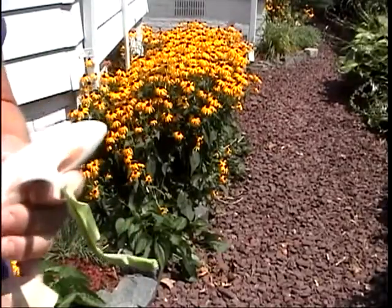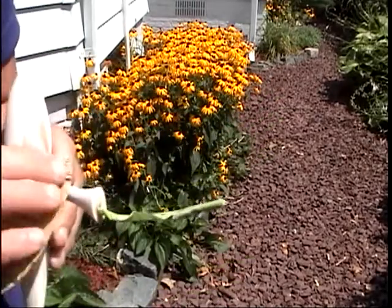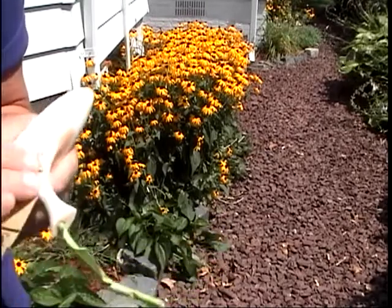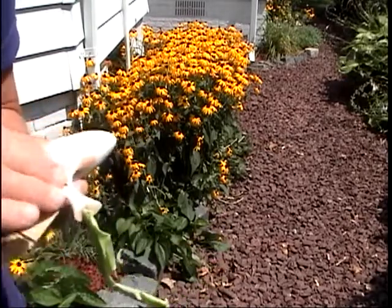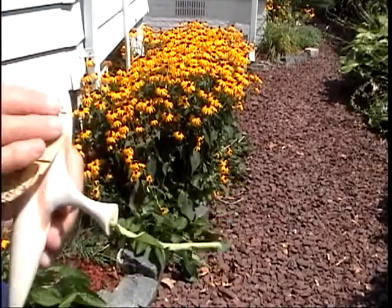Another thing that's really handy is when I can take this out in bright sunlight, I can candle it and I can start to see little spots where it may need another coat of clear. Because what happens, as soon as you break through into the raw wood, you can see, because of the wind, it's just powdering off and blowing away.